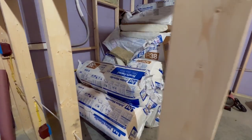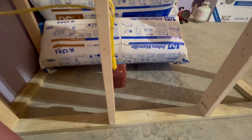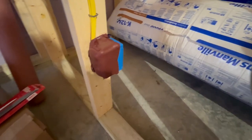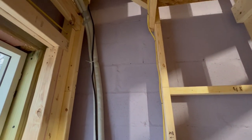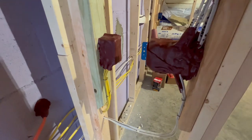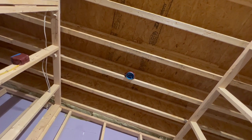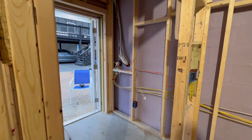Next, I want to focus on the putty pads. This is a great example where Henry has already gone around and placed acoustic putty pads — which you can get through thesoundproofingcompany.com or any acoustic soundproofing wholesaler. They wrap around all your electrical boxes as well as lighting boxes, and we've even used them to seal around holes where electrical and HVAC lines come through the wall. Those plastic boxes end up being huge holes in your system and can let in a lot of sound, so go through and put acoustic putty pads around all lighting, switch, and electrical boxes before you start laying drywall or insulation.